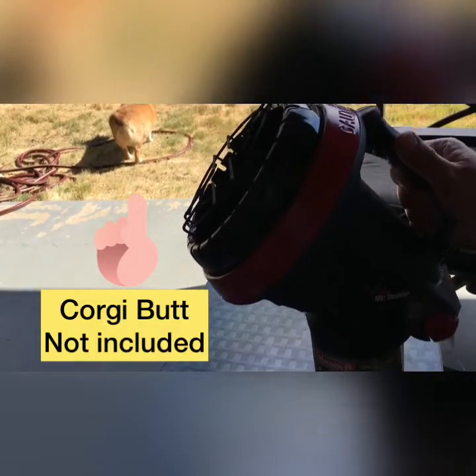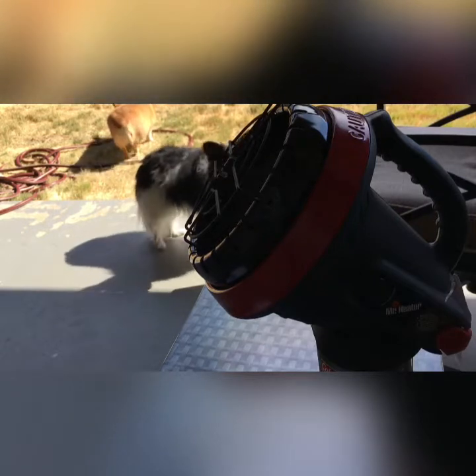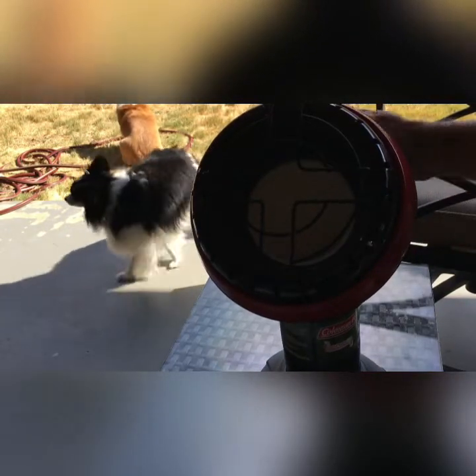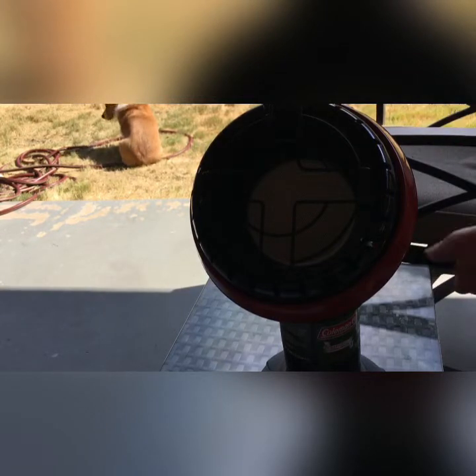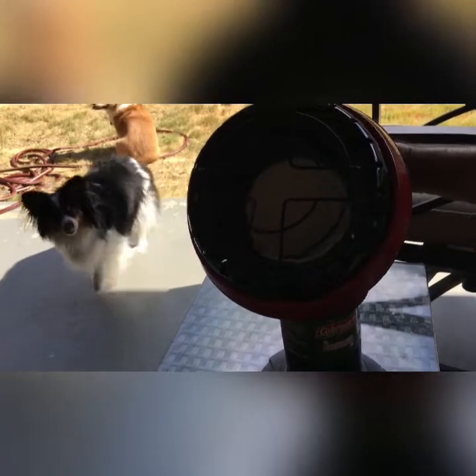I can see the heat waves coming off of the thing. Right up here, I can feel the heat. That was it — very straightforward. It has this ceramic disc and the gas filters through and heats the disc. The disc is then what radiates the heat forward. It's really not just the flame — it's the cumulative heating of that disc. It's a very simple design. As you can see, it can be lifted like this. You hold the on button, it lights the pilot, which it did — I can see the flame in there.